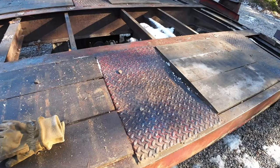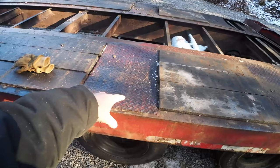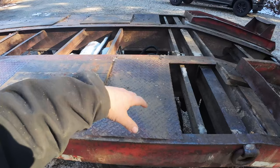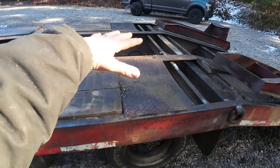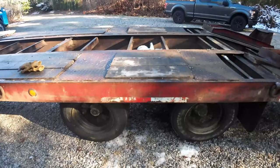His trailer has a big steel plate that comes across with steel bars welded across it. I think the guy I bought this off had a backhoe — that damage is from something rubber-tired. When you chain them down and they bounce, they slam those down. An excavator won't do that because it spreads the weight across. This one's really bad — definitely from a backhoe tire, probably using snap binders instead of ratchet ones. You really can't suck down rubber-tired machines with snap binders to stop the bouncing.